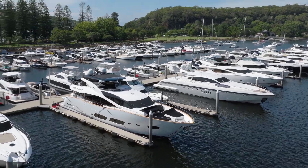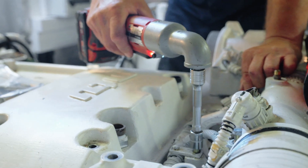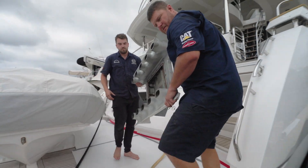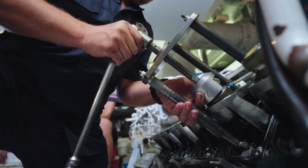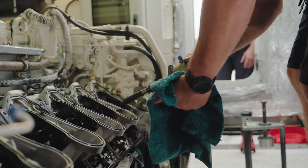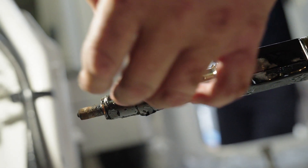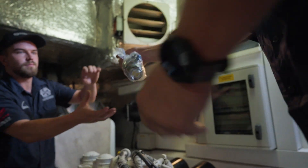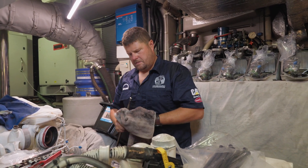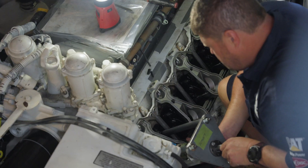Once we've protected the vessel, we go to the engine room — draining coolant, pulling off brackets, and getting set up for the next stage where you're removing big parts. As a wise man once told me, big parts win hearts. But it's important as you're stripping down the engine to inspect all the parts and make sure you're changing them for the right reasons. There's no x-ray vision with an engine, so you don't find a lot of these problems until you actually pull it down or remove one component to look under another.